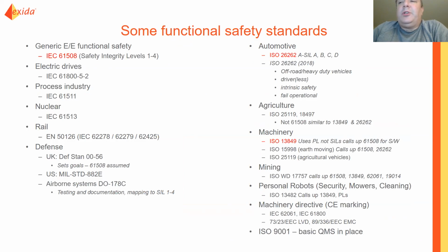And they introduced this concept of safety integrity level. A safety integrity level is a way of ranking how much engineering a particular solution needs, because what we don't want to do is waste time and effort over-engineering parts and failing to get to more critical parts as a result of that. So we rank and prioritize things, and we apply the appropriate level of rigor based on the risks.